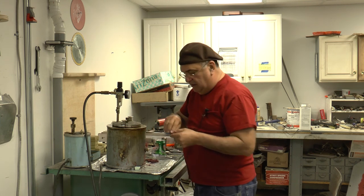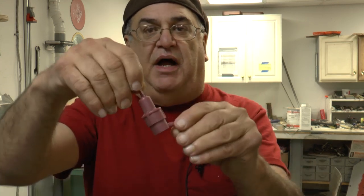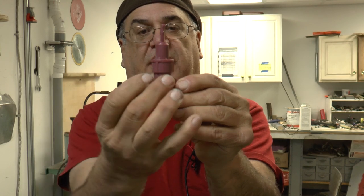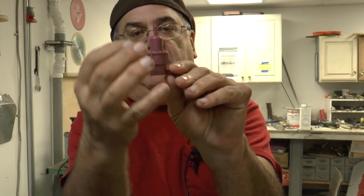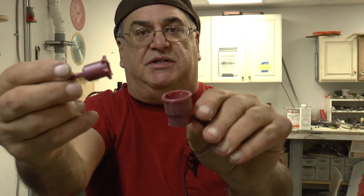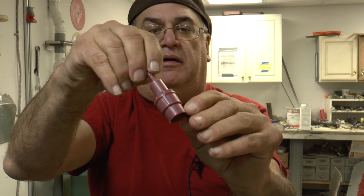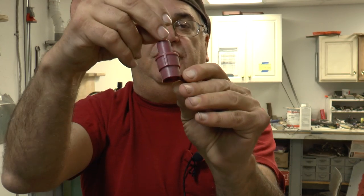And this is my safety valve top. This part right here on the bottom is a tooling. This course gets cut off. That's a sprue, and then I chuck it here, I turn this, then I hold it here to do the rest of the machining, but it's in two pieces. See, that's how I get those square holes in there, by doing it in two pieces.